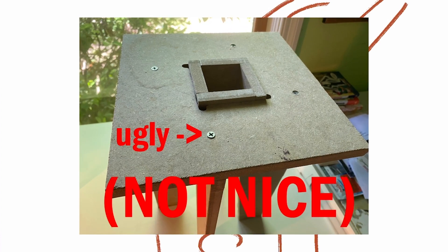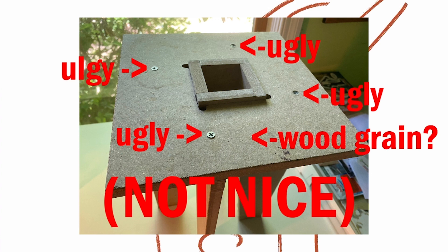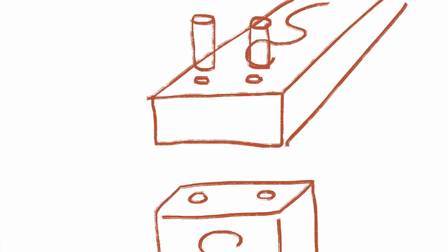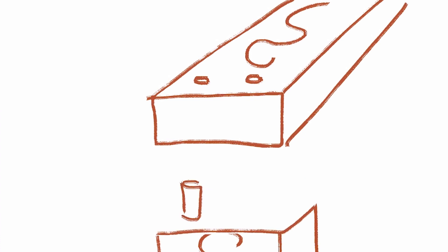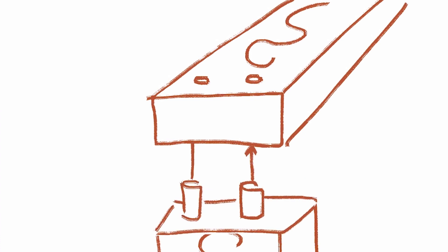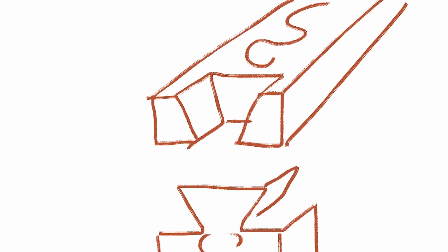If you're working on something nice you might not want to have screws showing, which would ruin the effect of the wood grain. So instead you might use a wooden dowel to create this joint — drilling a matching set of holes in the end of the piece to be joined and then driving a dowel through the horizontal piece into the vertical piece, leaving a wood grain effect as the only visible indicator of the joint. Or you could machine away some of the wood from the end of the vertical piece, leaving behind cylindrical dowel shapes to make the joint. In a lot of traditional woodworking, the dovetail joint was used — cutting a dovetail shape in the end of one piece and a matching pocket in the other, pressing the two together to create a nice strong joint that can't be pulled apart.